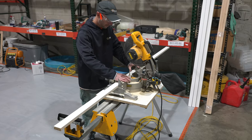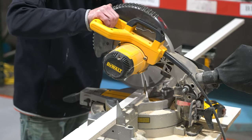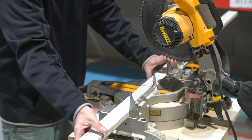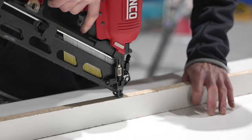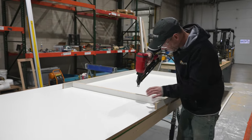It's great to use an actual miter saw for this. Anytime you're making these cuts with a little circular saw, it's hard to be precise, so I just like to use a miter saw. I got all my forms cut and now all I need to do is just set them right to the line, then I can use my two and a half inch air nailer and just pop these nails in right where they need to go — and that's going to hold just fine for me.